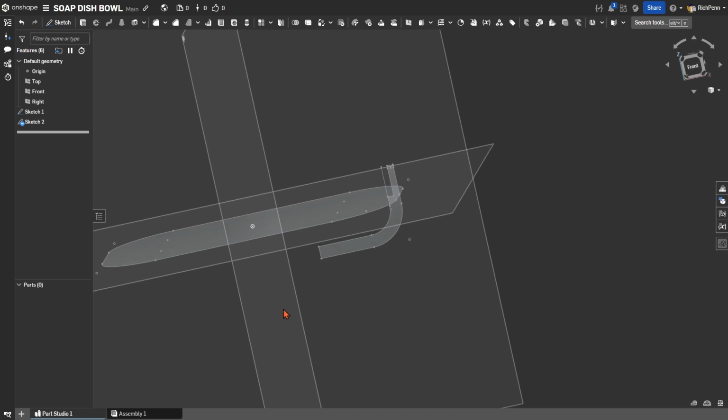So that's what happened when this becomes too long on a sweep and you have a corner and it crashes: you're getting overlap in the corner. You simply solve it by shortening this up, and I'm going to shorten this back up to 15, which is what we had.